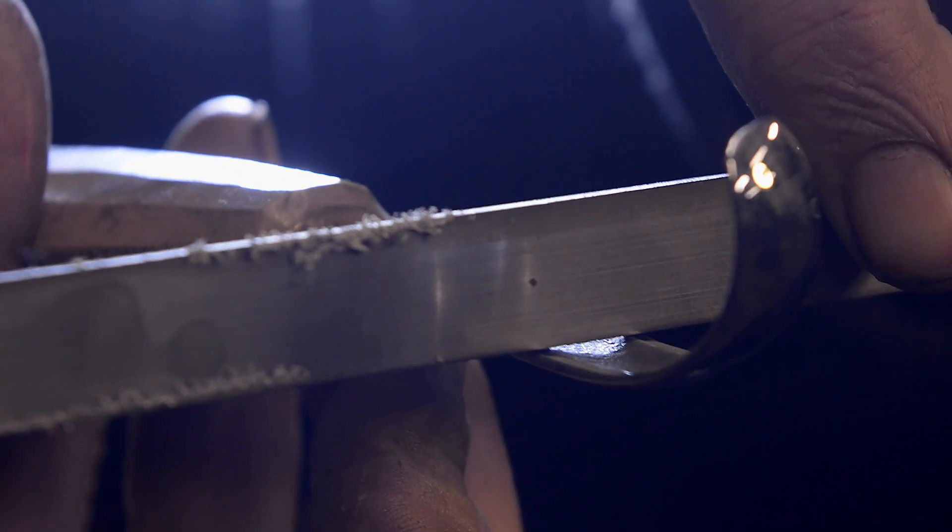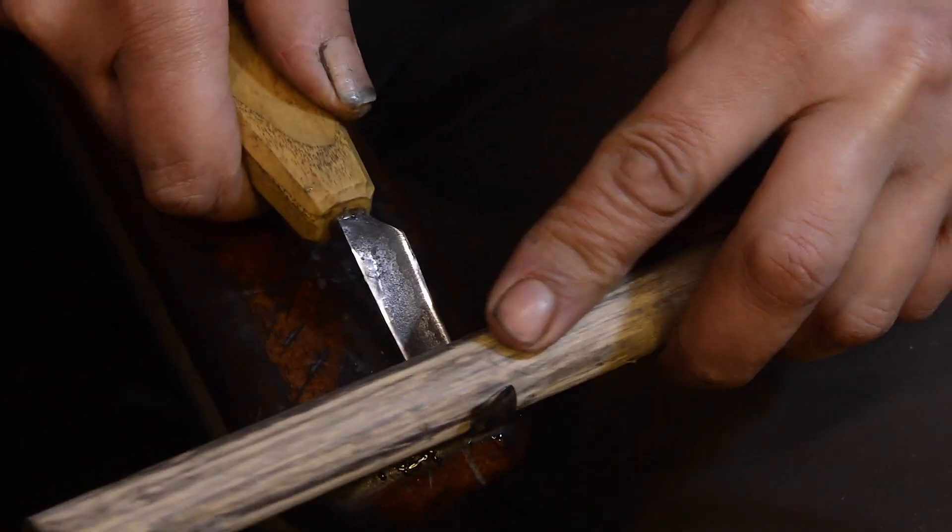My solution to that is not to do it — to stay away from the outside as much as possible. I've put a lot of effort into getting this profile right, and to a large extent you can just leave that alone. What I have done is put a lot of effort into hollowing the inside, so we've got these two characteristic tram lines which make it very easy to sharpen. If you put a dowel across it, it will automatically sit across and the tool will follow the dowel. Moving the dowel along, if you're working across these two tram lines, you'll hit the edge every time. So the sharpening is basically done from the inside; the outside, largely, you leave alone because it's much more difficult to do.